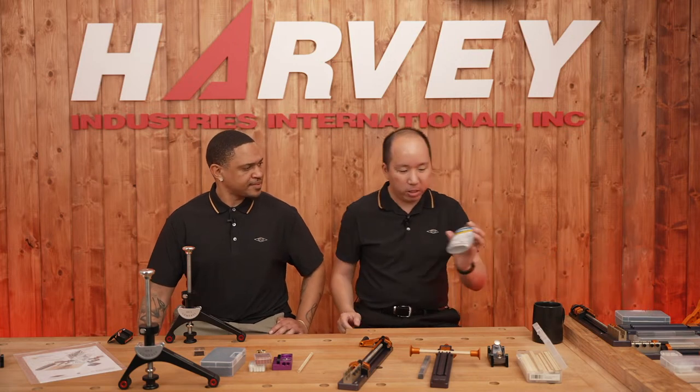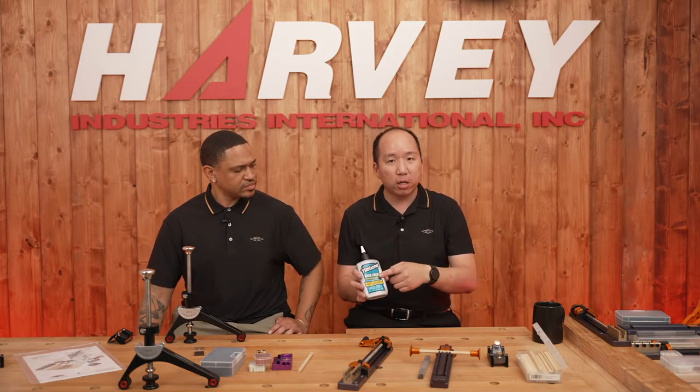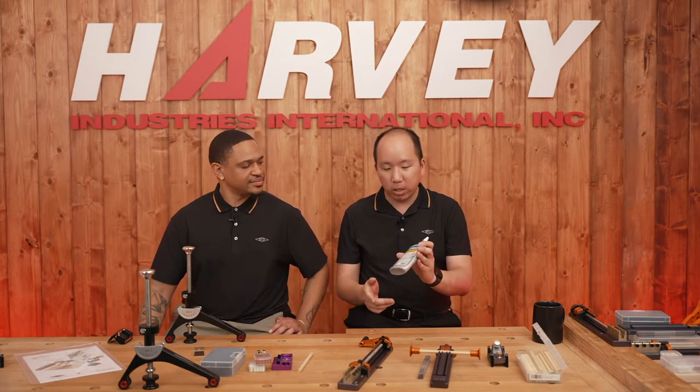Okay, well, that's a very good question. We specifically use, in this case, a quick drying glue. This one takes about 15 to 20 minutes to dry. So if we're trying to glue stuff up real quick, this would work. Wood glue is usually what I would recommend because wood glue takes a little more time to dry, but once it dries, it's safe to use. Wood glue is the most general recommendation. But if you are in a pinch, you can use a quick drying glue, even CA glue or super glue could help. But wood glue is probably the best.